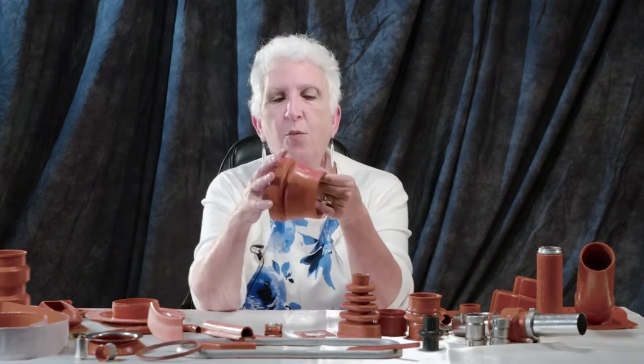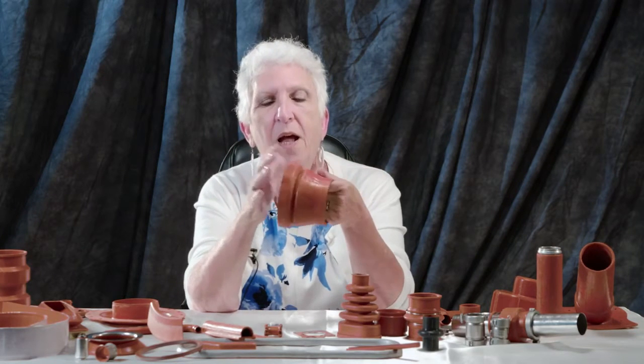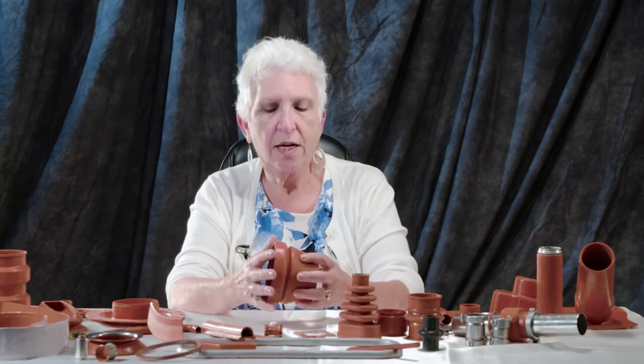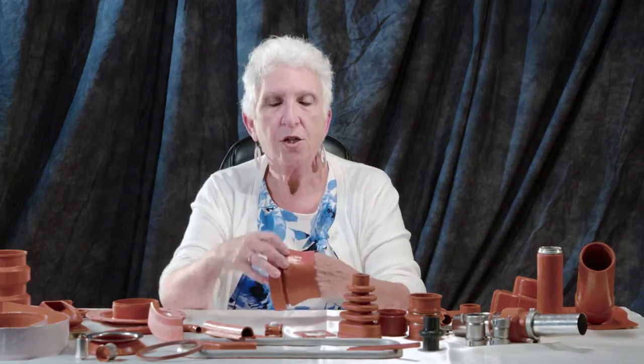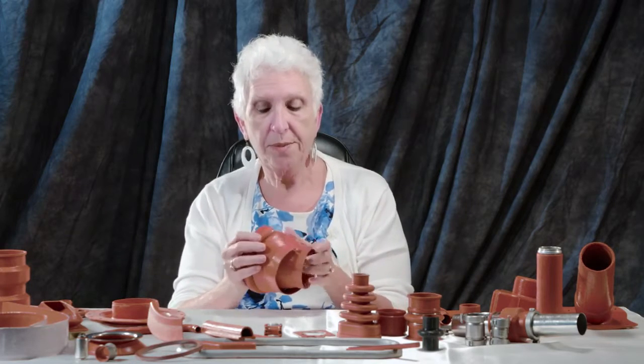The very first part we ever made told us that we could do all of these things with an overlap. Well, not the very first part, but the first duct. Boeing had an issue in the 1970s with power plant and strut. Everything in the system was good except this fire cover, and they needed to replace that without changing out the system, but they couldn't install anything because there were large units on either side. So they challenged us and said if we could design something that could be installed without taking the system apart, they would test it and be very interested. So we designed a wraparound duct, which simply rolls up and then is clamped.